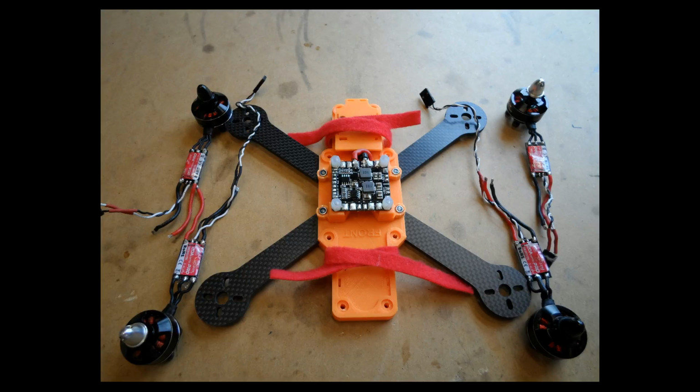Now one of the reasons why I chose the Kylin 250 motors, or the motors that I've done in the other videos which I've chosen for you guys to buy, which are the multi-star motors, is because when you chop the leads off, you can actually solder them. Some motors come with enamel around the wires, which needs to be scraped and filed off, which is really annoying and very time consuming, to be fair. So hopefully you won't be presented that problem.